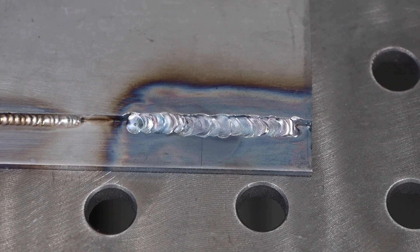Now let's take a look at a weld run with better arc length — keeping this nice and short. You can see I have a small puddle, it's easy to control. As I move my way along, it's getting right down into the root of the joint. I'm able to add that filler metal right into the leading edge of that puddle, and it's coming along nicely.